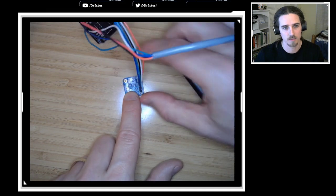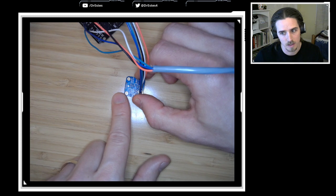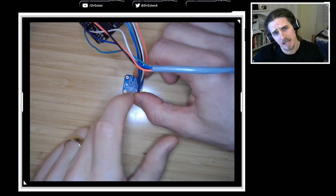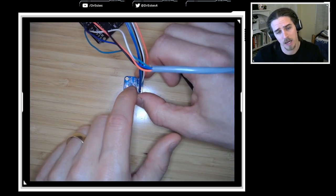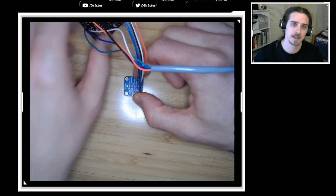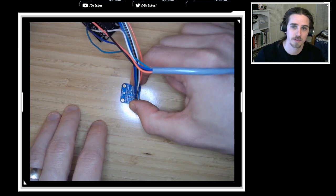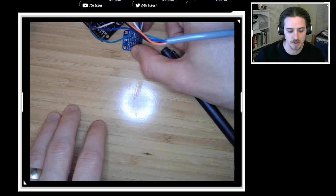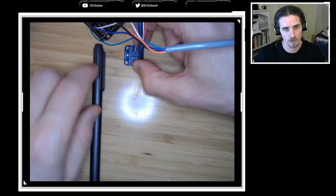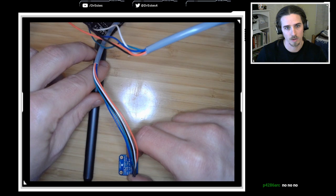But then, after you record this data, you're going to be able to convert that into actual inertial accelerations. I don't have you do this in the lab procedure, but if you wanted, you could take that data into MATLAB, integrate it, convert it to velocity, and even convert it to position. A fun exercise is, if you have a ruler, you can move the accelerometer along the length of the ruler.